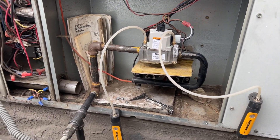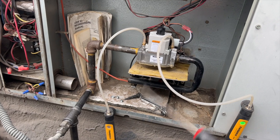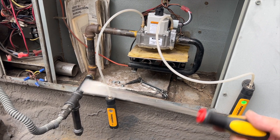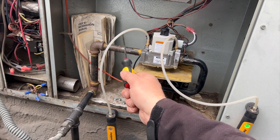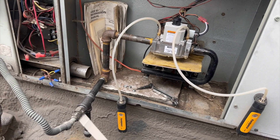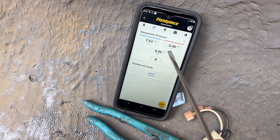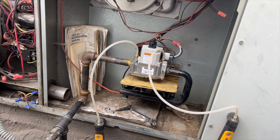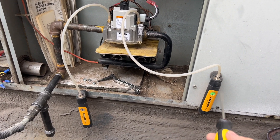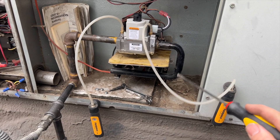She's been running a while and seems good. I did have to adjust the gas pressure — it was a little high. Anytime you install a new furnace or gas valve, you always want to adjust the gas pressure. They're pre-set at the factory, but the factory incoming pressure is different than what you see in the field. In this case we have 7.5 inches incoming. We're sitting at 3.4 inches water column differential. These wireless manometers aren't that accurate — I'm really going to invest in an SDMN6 for static pressure. They're great, but for real-time readings, not so much.